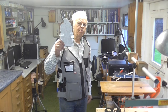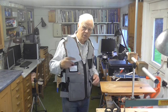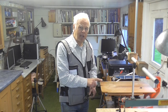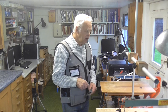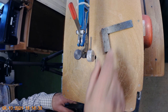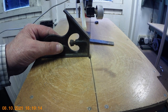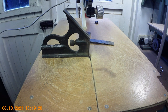I'm about to start cutting out the butterfly bracket. Before I do that, there are one or two things to sort out. It is important every so often to check that the blade is square to the table, because if it's not you'll get inconsistent results and the work will be different at the back to what it is at the front. You can check it using a try square - a little metal one. My blade is absolutely perpendicular to the table, spot on. It's always important to check that every so often because they do go out of square, especially if you've altered it to do some bevel cutting.